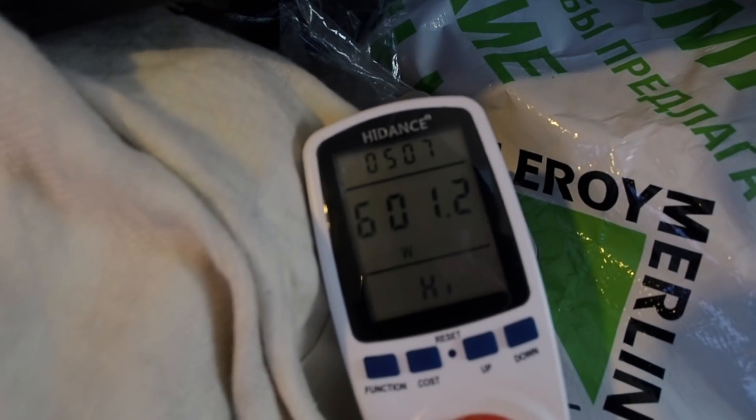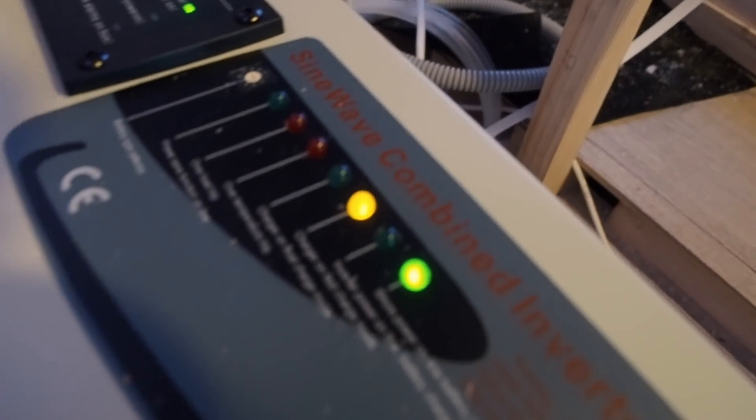My generator is working, and my inverter is taking up to 600 watts to charge my batteries — which is about 50 amps. My wires from the generator are connected to the AC power input ports, and the LED status panel shows that the inverter is in fast charging mode. The generator is running here, and you know — it's not even that bad. I bet you can hear it, and there's some exhaust smell, but not that bad. I could stay here and talk near my generator. The inverter now shows fast charging mode — so it must be about 50 to 70 amps, which is really nice.